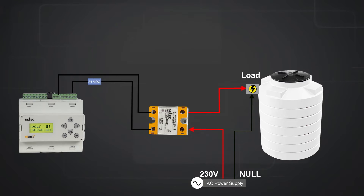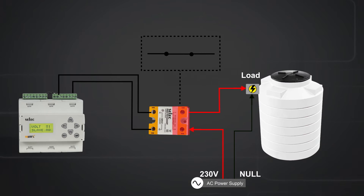When the PLC provides a signal of 24 volts DC to the SSR, the SSR input LED glows and subsequently the switch gets closed between terminals 1 and 2. So the load gets connected with the line and starts heating the water tank until the required temperature is reached.